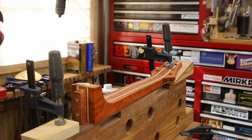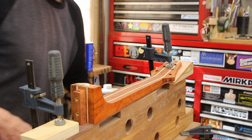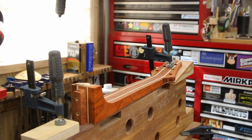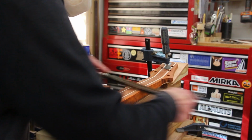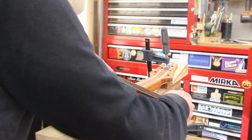I've got my neck set up in my carving book that I made in a previous video. I'll put a link to that in the description. I have the fretboard extension held in place using a padded caul, and I've also made a padded caul which matches the angle of the headstock. That way it's held securely but doesn't put any excess stress on the angled headstock. And it's time to grab the trusty Shinto rasp and start making some sawdust.